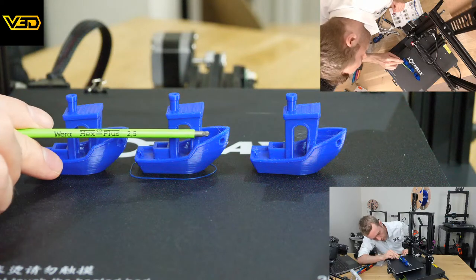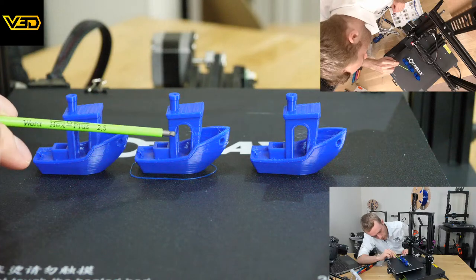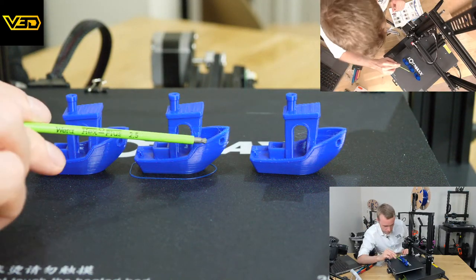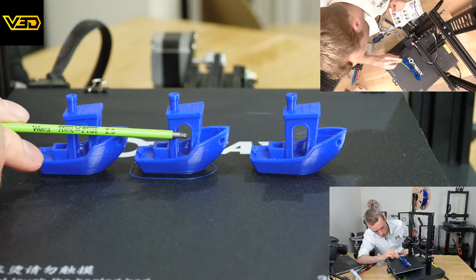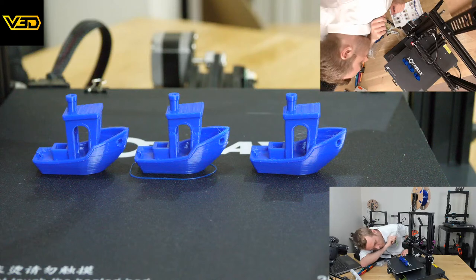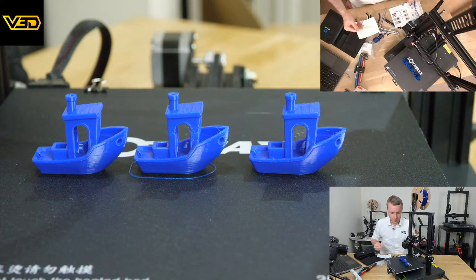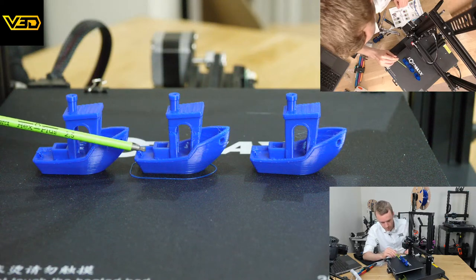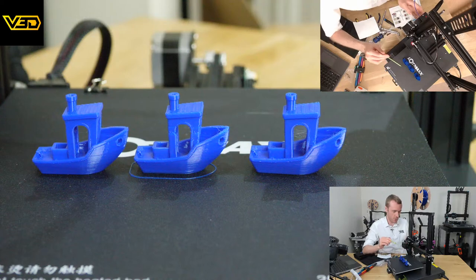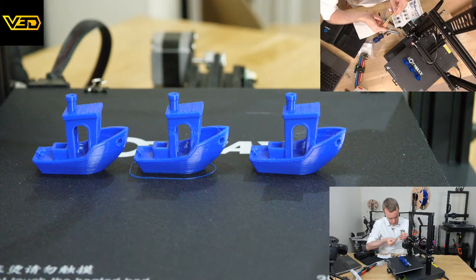So you've basically got, due to this geometry, I think, over here, or maybe it's a result of this, basically these two bits here are now really, really skinny. There's definitely a significant under extrusion in this layer here. Well, these few layers, probably 5 or 6 layers maybe, where it just was not extruding enough filament. That's where we saw some of these skipping steps. We saw that a little bit further up as well, actually. And that could also be related to either the torque here or some issue in the hot end, which I've not identified yet.